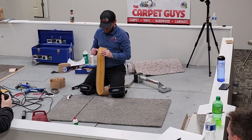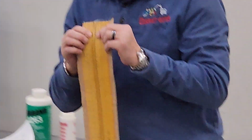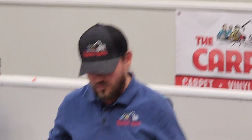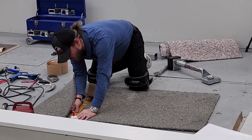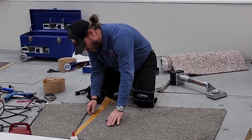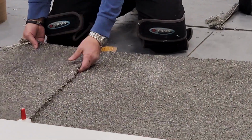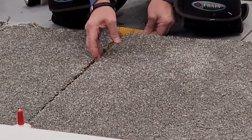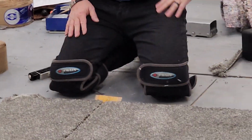The tape itself has got a bead in the middle separated by 2 black lines, as you guys can all see. And that helps you kind of guide the tape in the right direction and right position when you put it underneath your 2 pieces of carpet that you're gonna turn into one, okay? So just like so, set that on there. And make sure it's centered. And of course, the carpet basic, make sure that your yarn goes the same way.